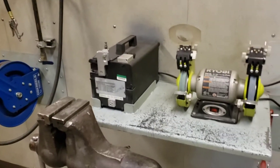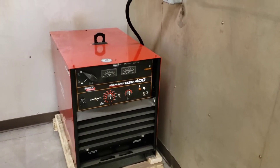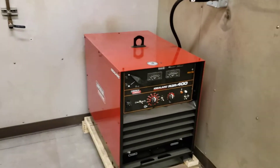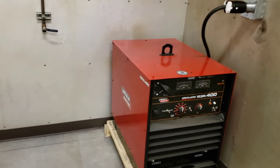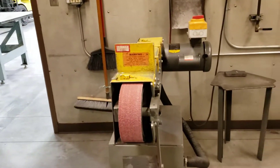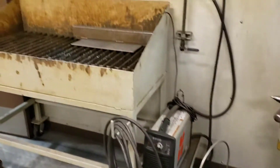This is our prep room — this is where we keep most of the dirty stuff. We've got a Piranha tungsten grinder and a small bench grinder for tungsten. This is our new Idealarc 400 we use for air arcing — we do quite a bit of carbon arc cutting and gouging. In my experience it's an invaluable tool for doing weld repair and all kinds of stuff like that. We've got two Kalamazoo belt grinders for cleaning up coupons and removing material. We're planning to have a third one installed by fall. And this is our manual plasma station — a Hypertherm cut table.